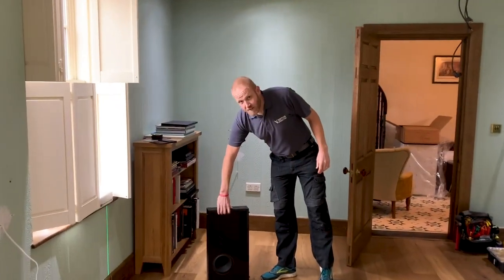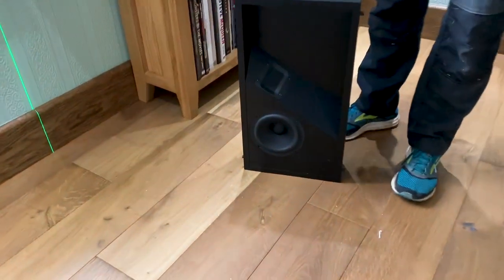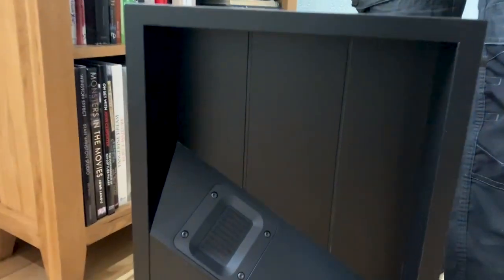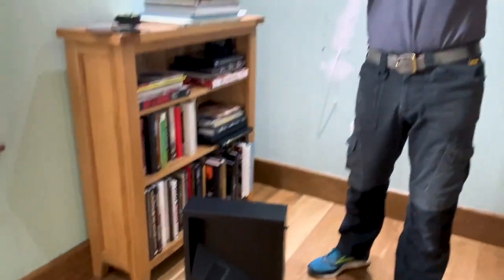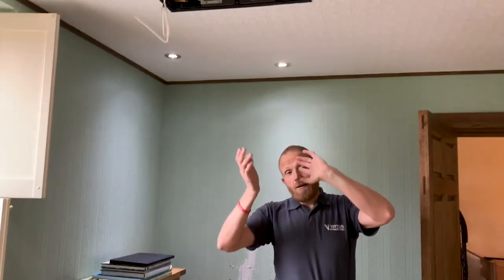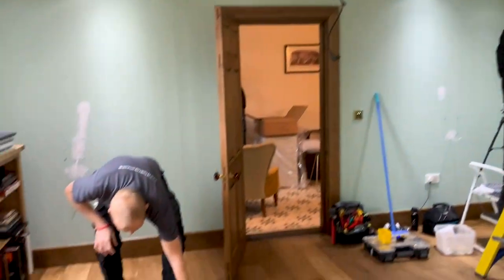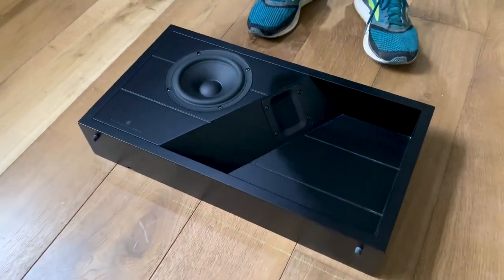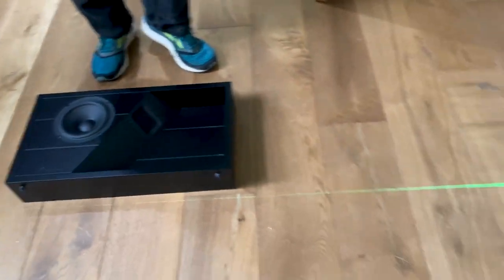This is the IC16 in-ceiling speaker, which is directional. In this particular room there are four Atmos speakers, and because they're directional there are two types — a left-hand and a right-hand. In normal scenarios we would fit these longitudinally down the room, but because the joists in this build go across we've had to switch them around, so the left is on the right and the right is on the left. The tweeter here is in the directional part and needs to be aiming toward the sweet spot seating position for the listener.